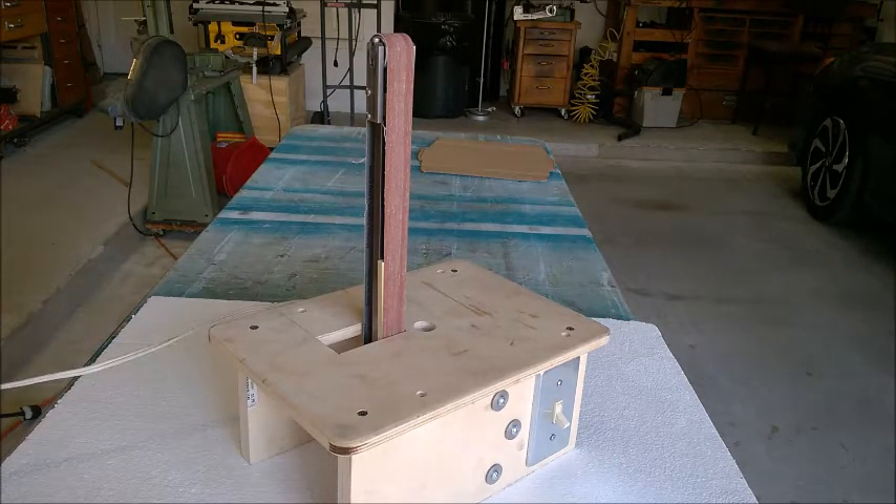This is my little 1-inch by 30-inch belt sander. The design was inspired by a fellow YouTuber named Justin Depew, who makes a lot of his own tools — he's built a table saw, a belt disc grinder, and some other things. Very creative fellow. I've got a link to his YouTube channel in the description. I like this design because it's simple — just two pulleys — and it accommodates sanding shapes and sizes that a more common three- or four-pulley belt sander can't handle.